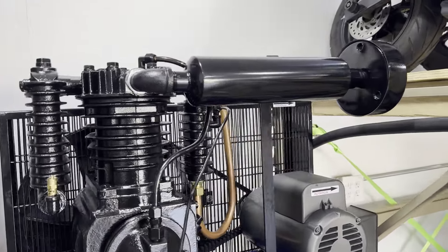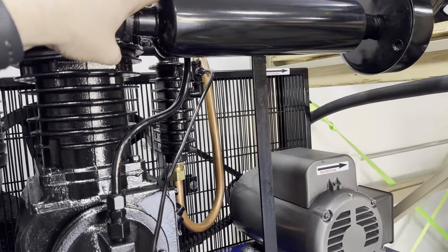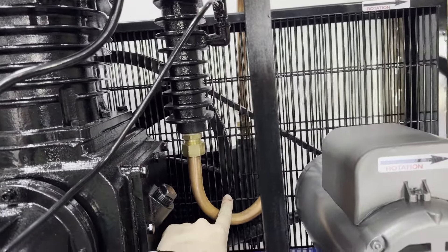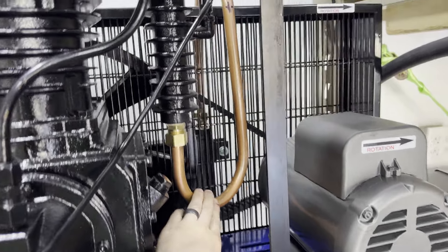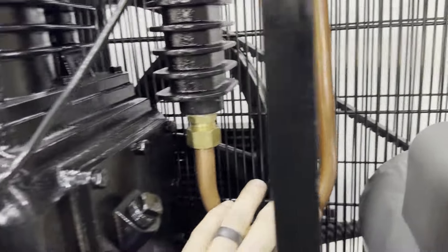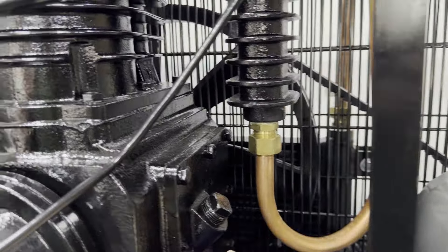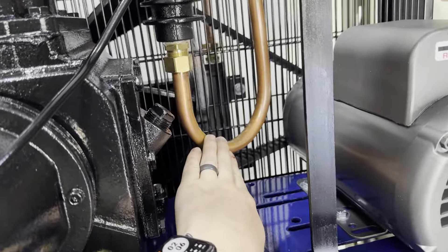For accessories, this unit has an air silencer which quiets the compressor down considerably, as well as an after cooler right behind here. This copper pipe gets very hot during extended operation — the air inside is essentially steam — which then passes through a radiator on the back side. Air is pulled through that radiator by the pulley, dropping the air charge to only about 20 degrees above ambient temperature, so the output hose is almost cool to the touch.